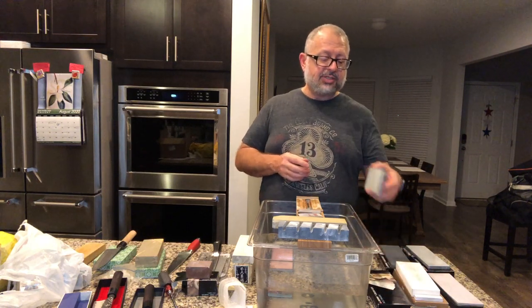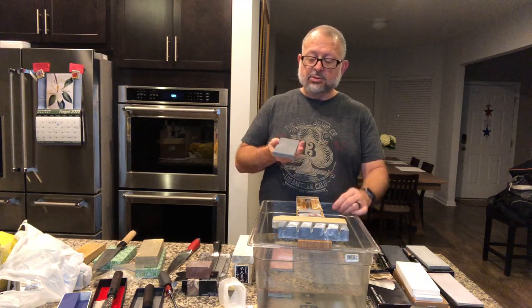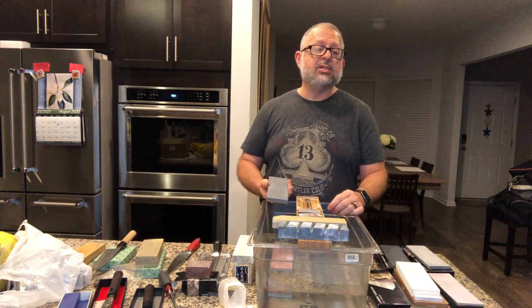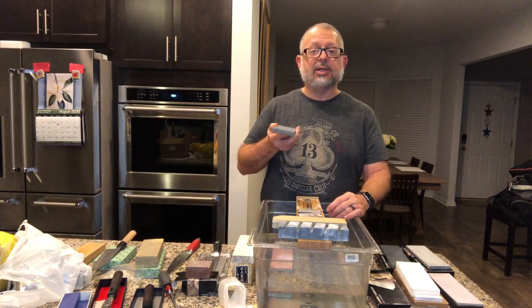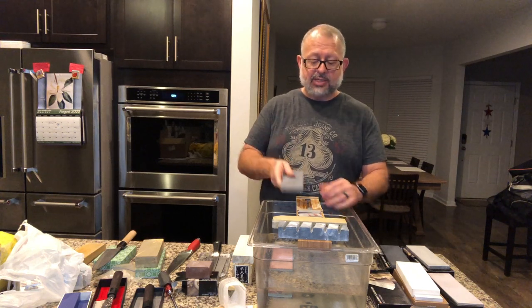And then 1,000 is, for me, maintenance. So if I'm putting you on the 1,000, you're just not sharp. I mean, sharp is relative to each person. I'm not polishing you when I'm using 1,000. I am removing metal and I'm trying to change the edge. So typically I would start at the 1,000.